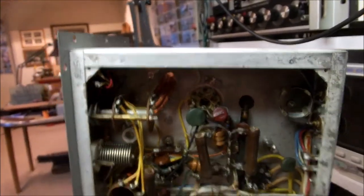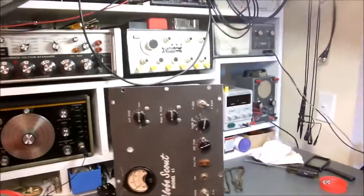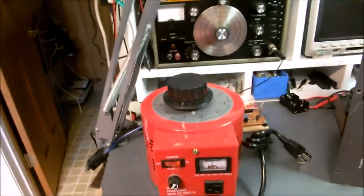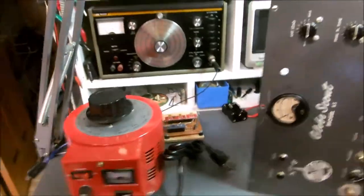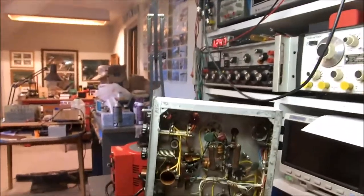There are some power resistors in there — wire wound — they're probably all right, but we'll find out. The switches and controls, if they're a little noisy, we'll work them all over and get this baby running like new. I've got some parts from a Globe Scout I tore down once to get the coils out, so if the meter doesn't work I might just have one ready to slide in. First thing we'll do is fire it up with the Variac, start at a low voltage and gradually increase it to burn the old gear in and reactivate the electrolytics if they're a little flaky.